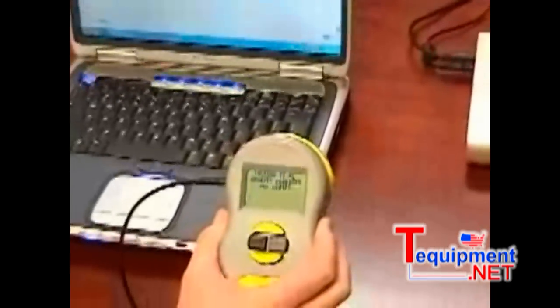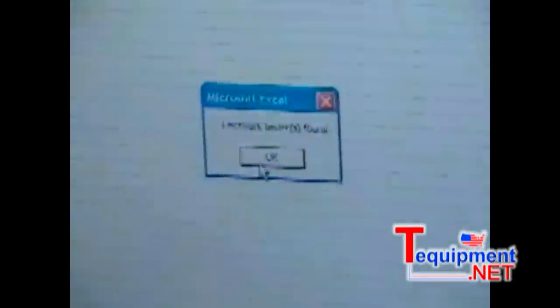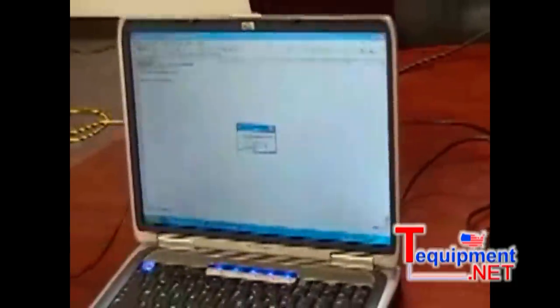After enabling macros, it will immediately search for a tester to see if one is connected. You can always tell it's communicating because the real-world certifier tells you it's talking to a PC. It warns you that unsaved readings are erased — this doesn't mean the readings stored in the flash memory of the tester, but any that you might have put in before you shut it off and failed to store. As for readings stored in flash memory, they're there until you go into the tester itself and erase them. Importing them into Excel will not erase those readings.